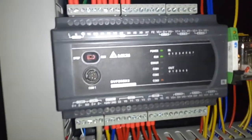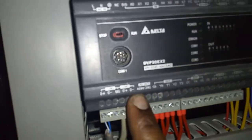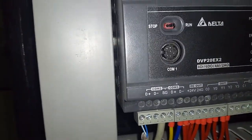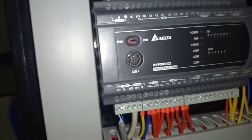The PLC now has power. Of importance to note is that this PLC runs off a 240-volt supply — line and neutral come in directly at 240 volts. It has its own 24-volt DC output, which we can use for interfacing with the input circuits. So with this PLC you don't even need a separate DC supply — it is self-sufficient and very good for small as well as complex projects.